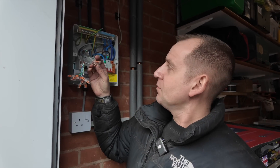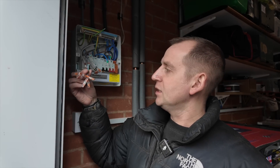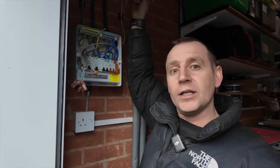You data boys are not going to like this - I haven't got jelly crimps, I'm really sorry. So this is the two EV Ultra cables: the brown and the brown-white connected up, and that's giving it continuity through to the EV Ultra in the house for my CT. And then the rest of these cables are just joined up, which goes to this Cat5 with an RJ45, which goes into the network connection up here.